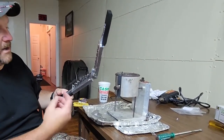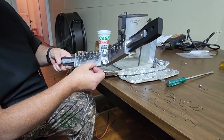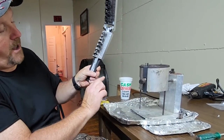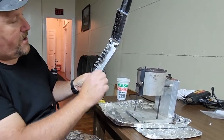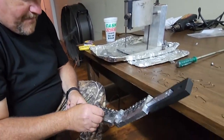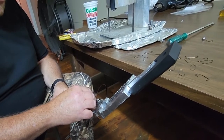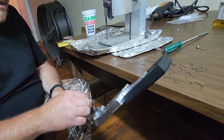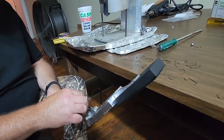You want to lay your mold on your pot while your lead is melting to keep it hot — it makes a better pour and easier to get them out. We're both doing quarter, eighth, one sixteenth, and one thirty-second. The mold gives you the hook size, but you can pour them with a number one hook, no problem. With the sickle hook, the way the bend is, the hooks overlap each other with the one thirty-second, so you have to do those by themselves. This is a great hobby — a good way to save money. I get a hundred hooks for about seven bucks at my local tackle store, and you can get lead weights at a garage sale.